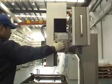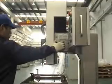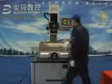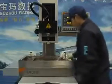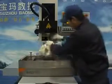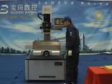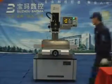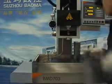Please raise the Z-axis with the white button until the distance is enough to put the level in. Clear the anti-rust oil on the table and on the clamp. Move the XY axis to the center of the table by turning the hand wheel. Take out 2 levels and put them on the work table vertically like a T.